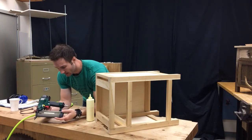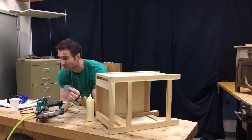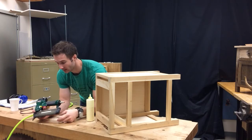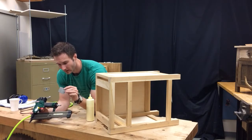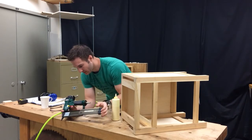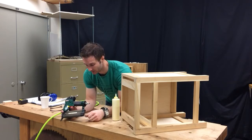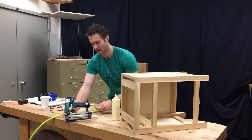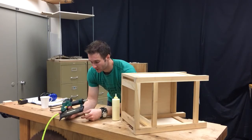You guys haven't used this before — this is an 18-gauge brad nailer. We're going to be using two-inch brad nails. They're in my office if you need to get them. To load it: push this little button down, pull the slide back. There's a tiny little head on these nails — head goes up, obviously — and it goes in here like so, then click. Real simple. The air pressure is going to be set at 100 PSI, and I pretty much leave it set at that pressure for everything we do in here.